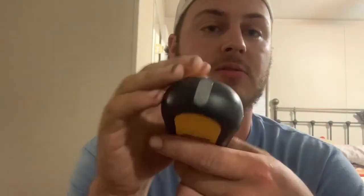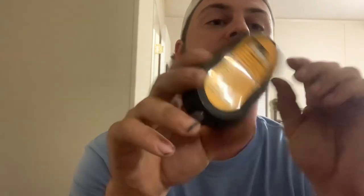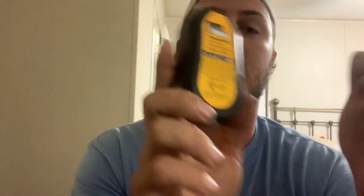This is the transmitter. You plug this into a receptacle and this red light will come on indicating power. Now this isn't like a plug checker or a GFI tester - you don't have any diagram here, you don't have correct, open ground, open neutral - just one light indicates power is on that circuit.